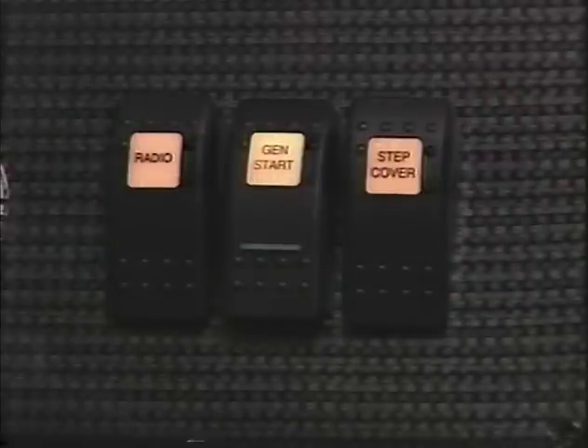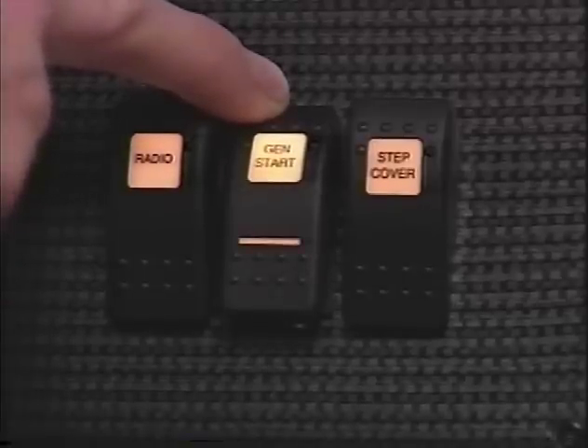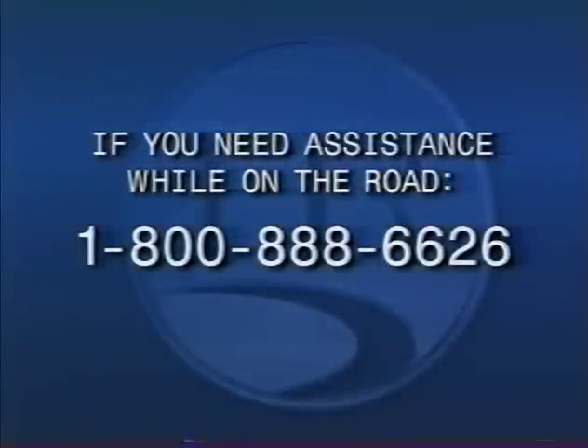Should you inject air into the fuel system, make sure you fill your tank to more than one quarter full, then prime the generator by holding the start switch to the stop position. This will run the fuel pump only, bringing fresh fuel to the engine and forcing any air in the fuel system back into your main tank via the fuel return line. Prior to shutting down the generator, turn off all air conditioners and heavy electrical loads for a couple of minutes to allow the generator to cool. If you should need assistance with your generator while on the road, call 1-800-888-6626 — you'll be given the phone and location of the nearest Cummins Power Generation Service Center.